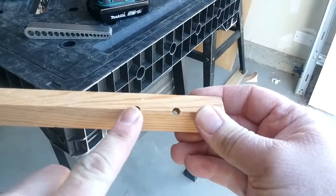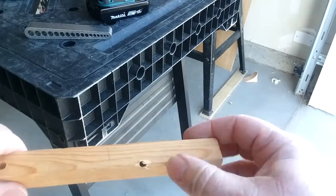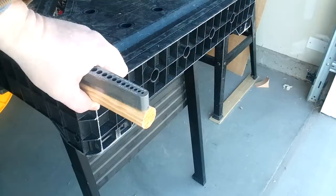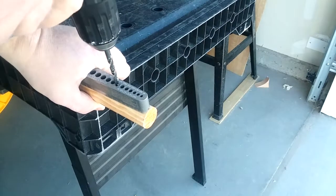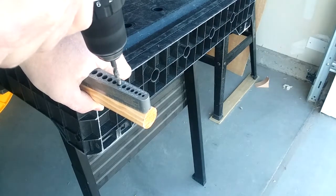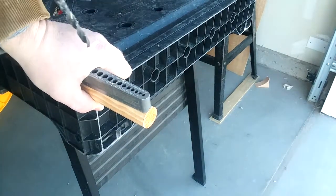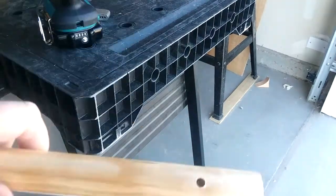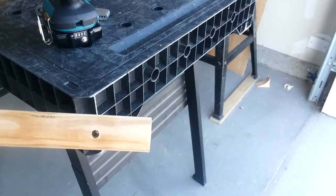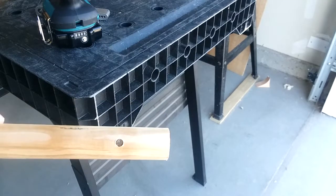This is the first one, there's the second one — I took a little more care in placement and it came out better. My audio failed here, but what I'm doing is using that V-groove on the bottom to place on the dowel and then drill the hole. It worked out really well, and you'll see it drilled a straight, true, clean hole. So I was very satisfied. Now I'm going to take it to a flat piece of wood, which is really my intended use, and we'll see how it performs there.